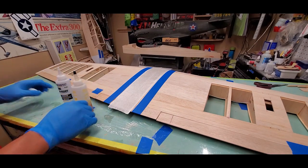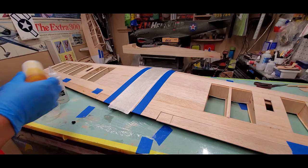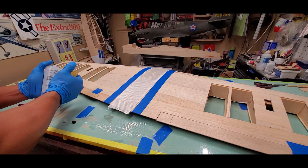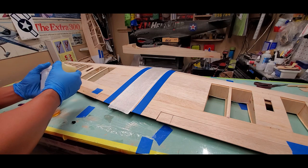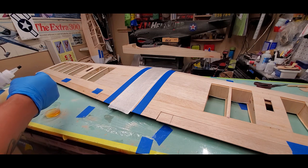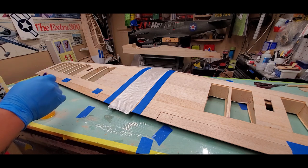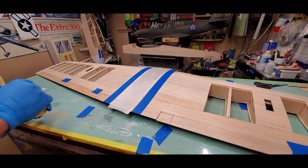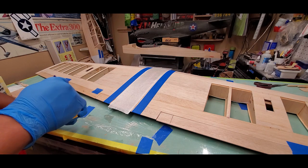So I'm gonna go ahead and mix up some epoxy resin. Now, we are not using this glass for a painted surface. This glass is actually there for strength. All right, so I'm not too worried about saturation coat and all that other stuff. I mean, we're gonna saturate it, that's for sure. We're gonna make sure it's saturated and that the resin is gonna penetrate that wood.